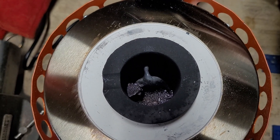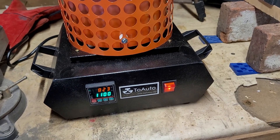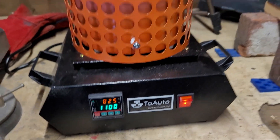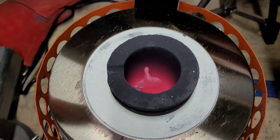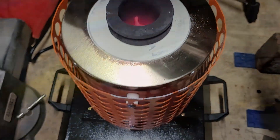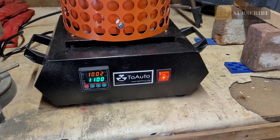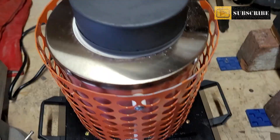The color of the copper is getting dark so it's getting quite hot now. Currently 30 minutes into the melt at 823 degrees Celsius and rising — I think we'll reach the desired temperature at minute 40. Now 40 minutes in, just reached 1000 degrees Celsius and still rising. I think we should be there in five minutes.